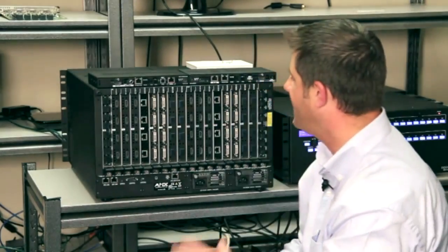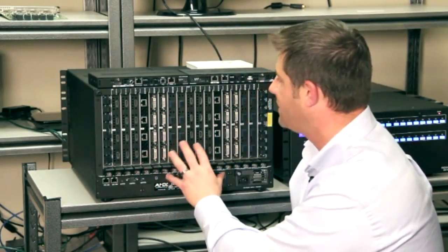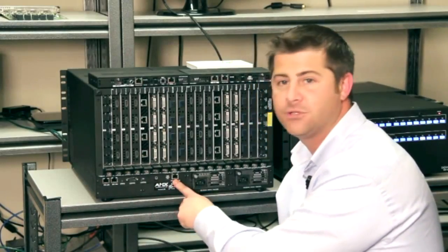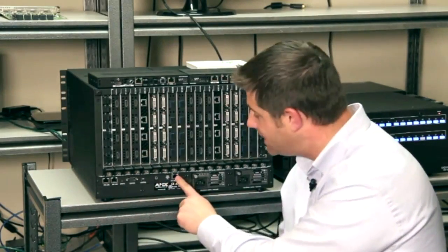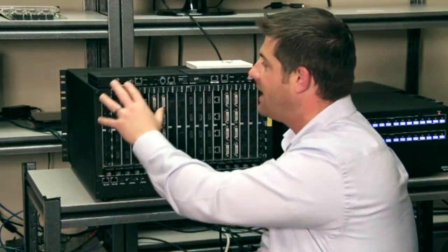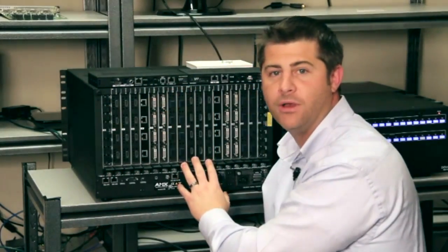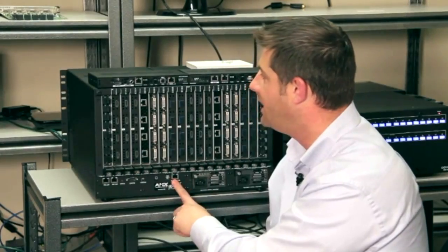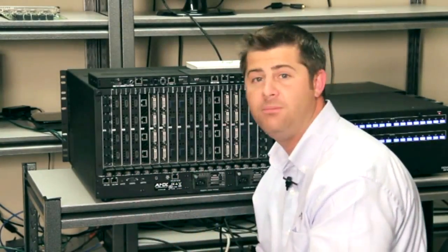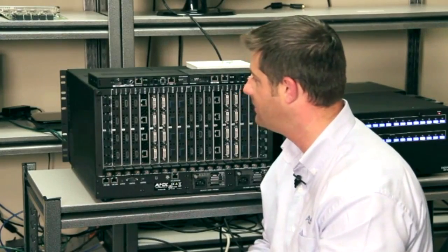The overall product family really provides a great deal of functionality across multiple platforms, including an embedded Ethernet switch, which is inside. So a single gigabit link is able to provide 100 megabits of Ethernet to every single transmitted input or output from that shared gigabit link. So not only is it a video, audio control, but it's also an IP distribution solution at the same time.